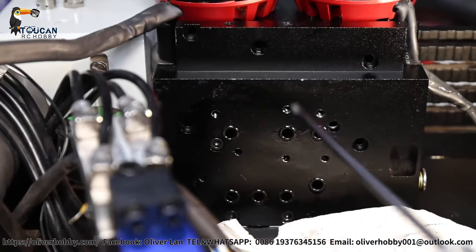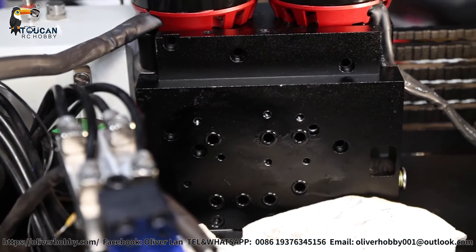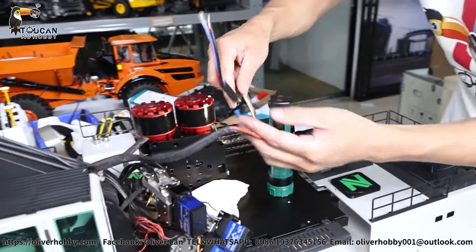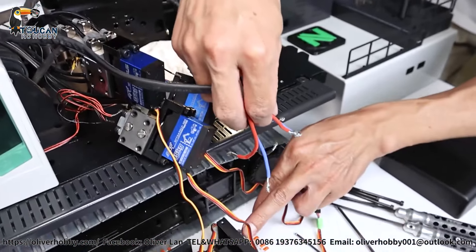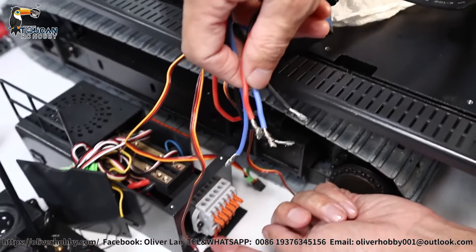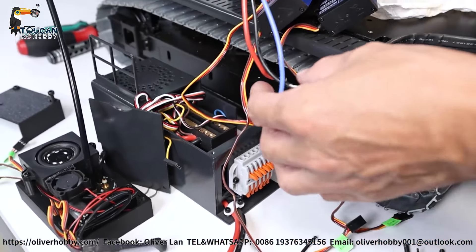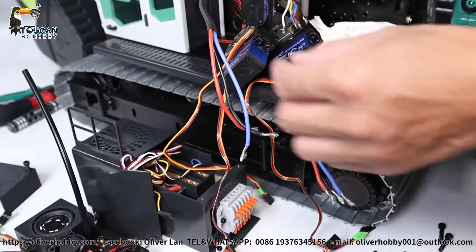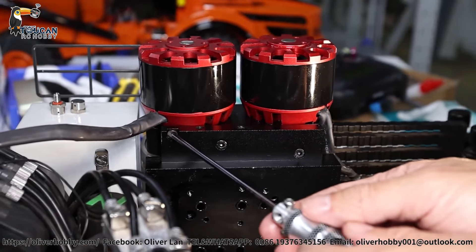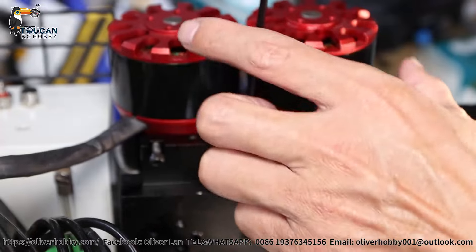Now I will remove this one as well — pushing and bending it to the side. Here is the middle connection block, held by two screws. Remember the position. That's the oil channel, in and out, the main oil channel. Here is another oil channel — this hole for the oil channel is coming from the forward pump, going in and coming out from this hole.